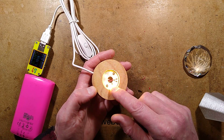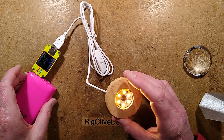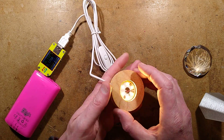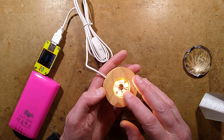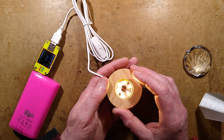This has 6 LEDs and it's currently running about 180 milliamps. It's wavering a bit because I think there's a bad connection — some slight connection resistance and significantly low voltage. But there are 6 LEDs and 2 resistors in parallel feeding all the LEDs in parallel, so it works out to roughly 30 milliamps per LED, since the total is 180 milliamps.